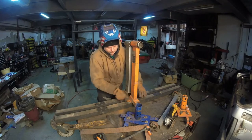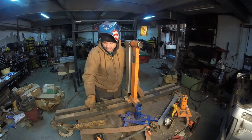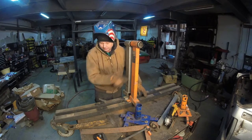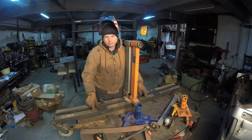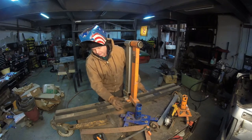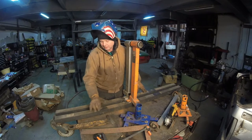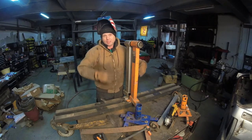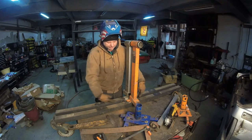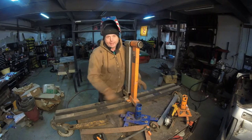Instead of having all the load transferred to this one small 6-inch section in the center where it could possibly buckle, I'm going to take a piece of square tubing and put it right here in the center, or as close as I can. So what it's doing is dispersing the load. I have a load here, then I don't have a load, or it's load bearing for about a foot, maybe a little over, and then it stops, so this other part is bearing it, so it's actually making a structure. I'm also going to do a little bit on the bottom for another triangular structure off of this and off of the back.